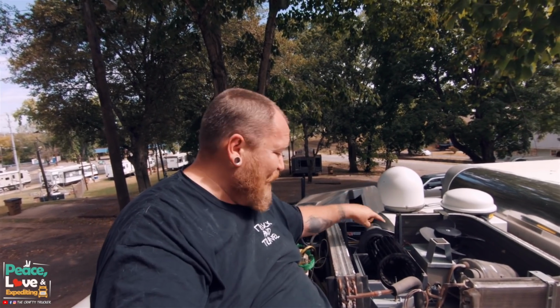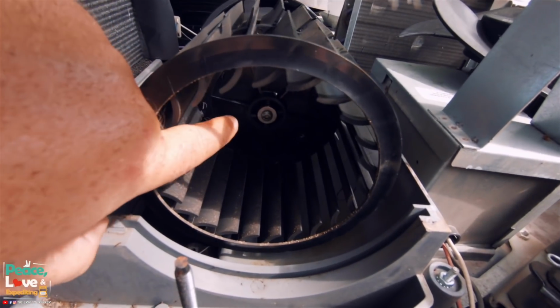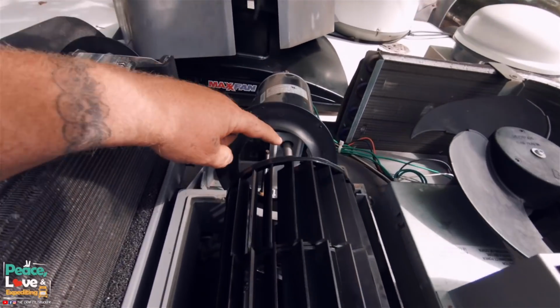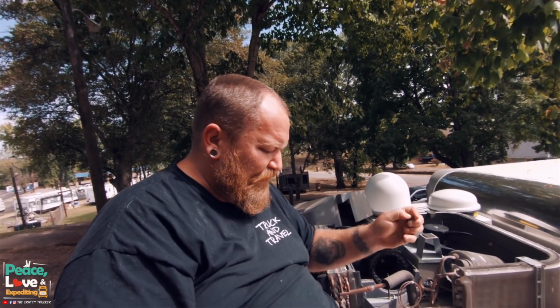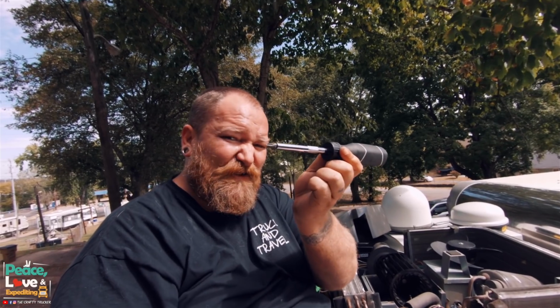I don't know a lot, but I know I can change this fan, so I wanted to show you guys how to do that. Let's see if we can get a look inside there. So we got a Torx screw that we have to loosen to be able to get this fan motor off of the spindle for the blower motor. It looks like it's going to be a Torx bit T20, and I got this little screw gun, or it's a ratchet screw thing just to make things a little bit easier. I can change the bits out on the tip of it, and of course it's got storage on the end for extra bits. I'm going to take this off.